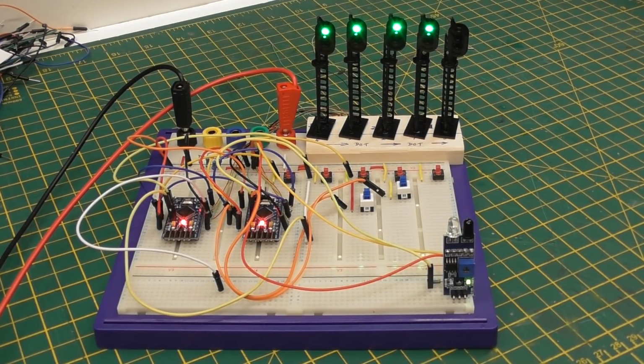And a way of bringing out a few pins to a header on that board that you can plug a remote time adjuster into. Yeah, and you can close a switch on it, which will say I want to set the timing for signal 1 or signal 2. And then adjuster pots, 4 of them, for the timings on signal 1 and signal 2. And then once you've done that, when you turn the adjuster switches back to normal again, the system then saves those into the onboard EEPROM. And then every time it loads, it reads the values that are stored in the onboard EEPROM.